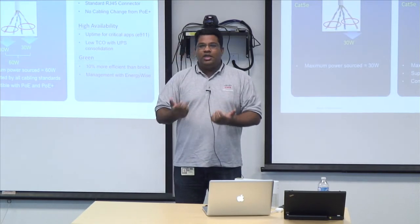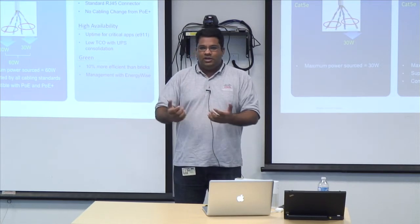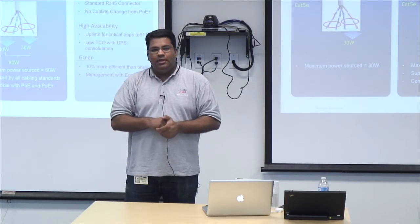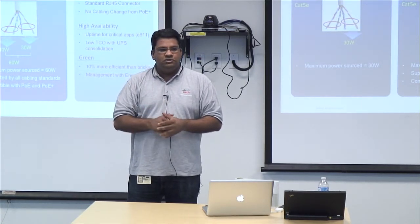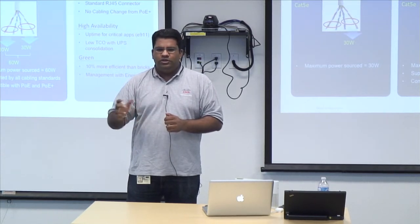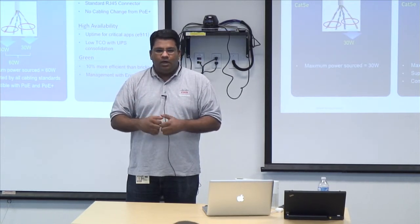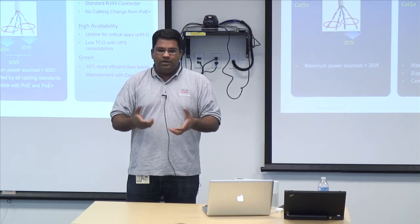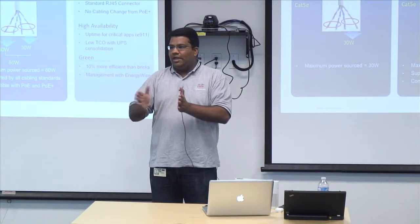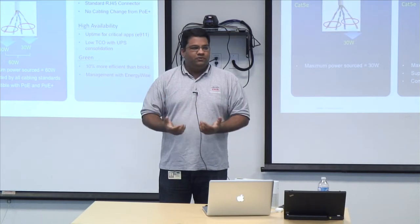And we also came to know, after we launched at Cisco Live, somebody told us this fact. The power bricks that you use, like this one on your laptop, are actually 45 to 50% efficient. That means if they're rated for 90 watts, they're actually pulling more than that, 140, 150 watts from the wall. Our power supplies are built for 80 to 90% efficiency, and that's at idle. As soon as you start using it, the efficiency goes even higher. So it's much more efficient.